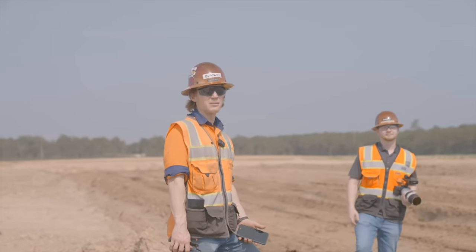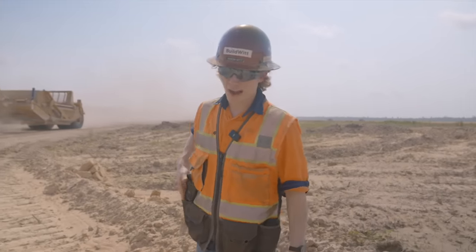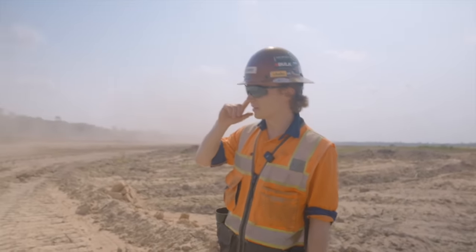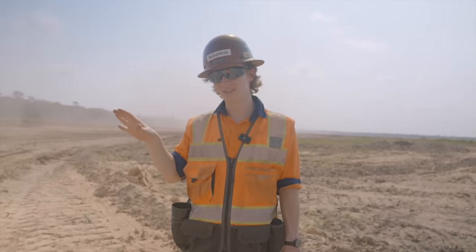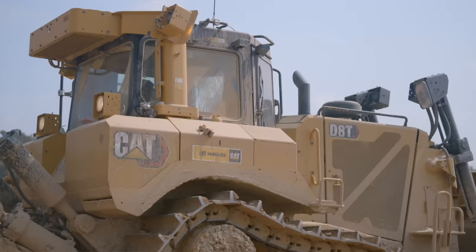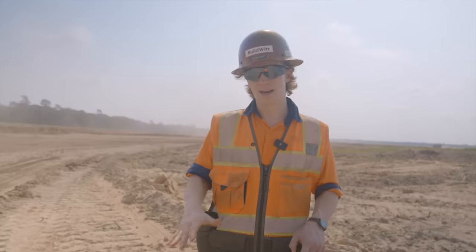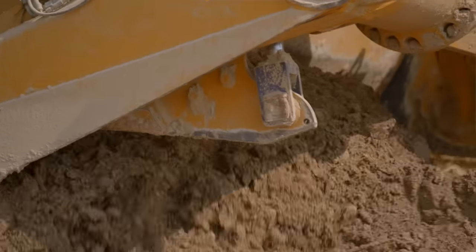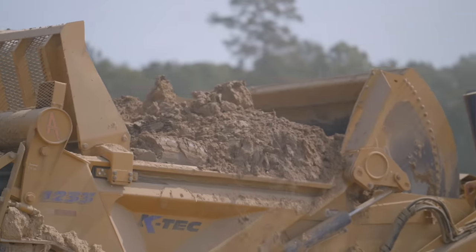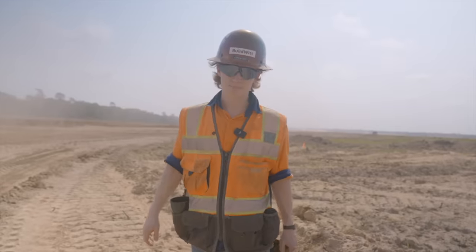It's the first time I've seen those double pans. That works like a charm. That right there is a K-Steiger tractor pulling two K-TEC 1233 pans — I believe that means they're 33 yards each — pushed by a D8 over there. The D8 gets up on the push block on that back pan. They only load one at a time: the first pan lowers into the ground, drags across, fills up, then lifts and closes the apron. Then the second pan drops into the ground, loads up, and takes it all the way down to the fill area.